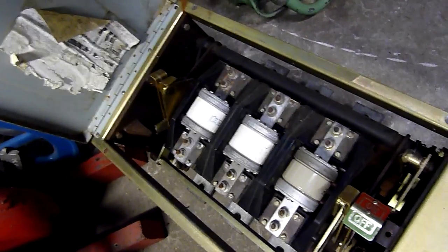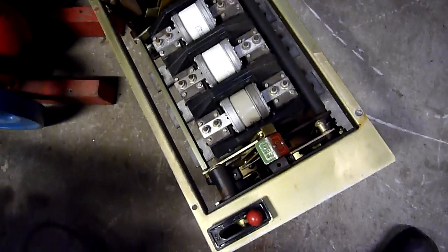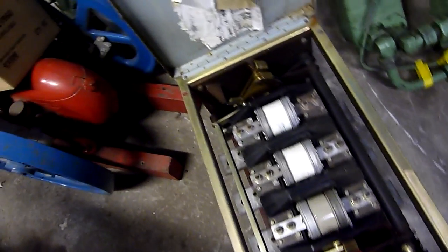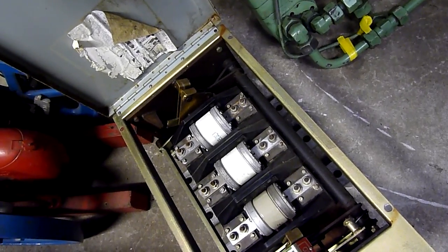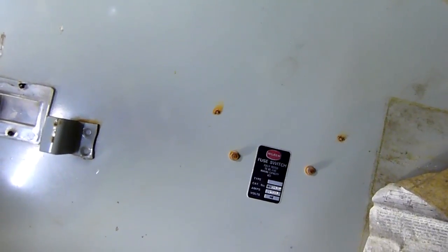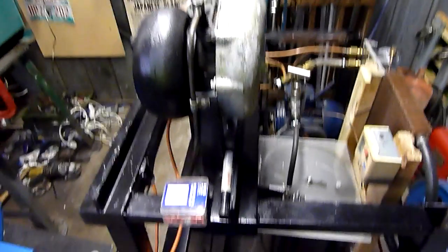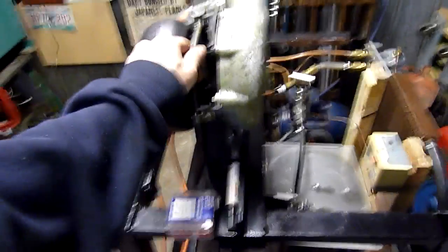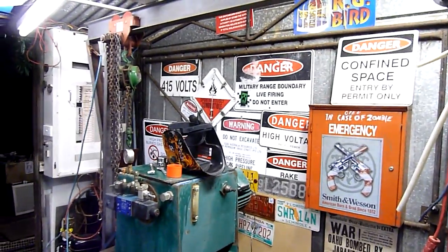It's designed to be operated vertically, which is why I'm having trouble operating the mechanism — a lot of it's gravity dependent. I'm sort of fighting the springs and the weight of the mechanism. It's a fuse breaker, of course. That lever has to be in the off position before you can open the actual cabinet door, and when the door is open you can't turn it on — it's a safety feature. You can only change fuses once it's off and it's open. It's a fuse switch by Nielsen. Thanks for watching — hope you enjoy the evening and what's to come. Stay tuned for lots more.